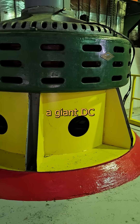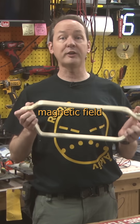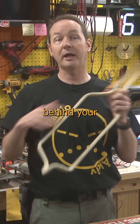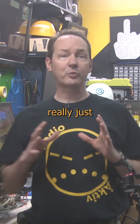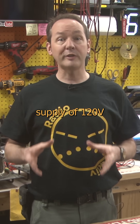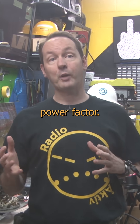This generator operates by spinning a giant DC electromagnet inside a ring of wire coils. The moving magnetic field creates a current in the coils and we ship pesky pixies down the wire to the outlet behind your mom's bedside table. We feed the big magnet with a machine called an exciter, which is really just a variable DC power supply. Typical for this size generator is an exciter supply of 120 volts DC at about 50 amps, give or take. We tweak those numbers to set our power factor.